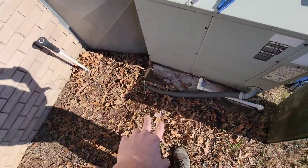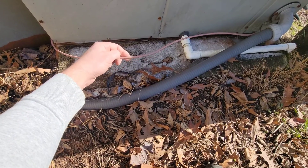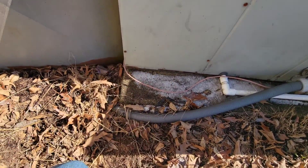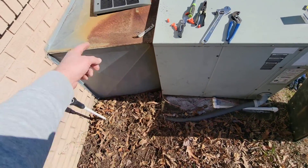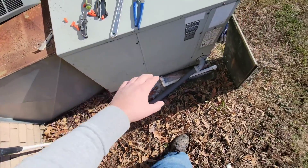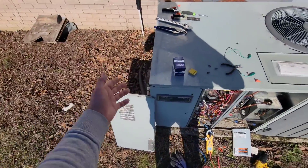I found some thermostat wiring over here that was damaged. Whenever you have thermostat wire that is open like this, it can become easily damaged. Look for nicks in the wire, look for spots where water has gotten into that nick or crack — you might find water, you might find corrosion. If you have damaged wire, replace the wire. If it's not in conduit it's going to get easily damaged — it could get hit by a weed eater or an animal could come out and chew on it. I replaced some of the stat wire, also found a splice and replaced a section of the wire. So check the condenser section, make sure no wires are touching copper, check the thermostat wire — if it's laying on the ground and not in conduit, replace it. It could be the thermostat wire, it could be the thermostat.